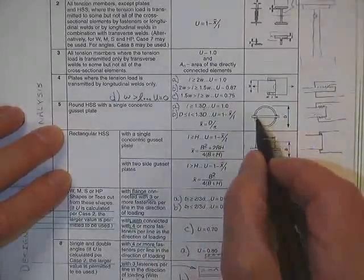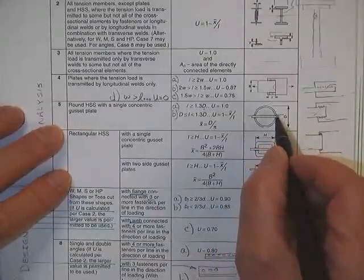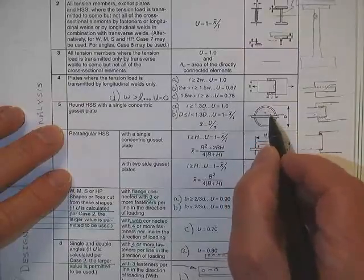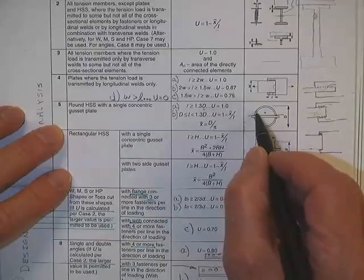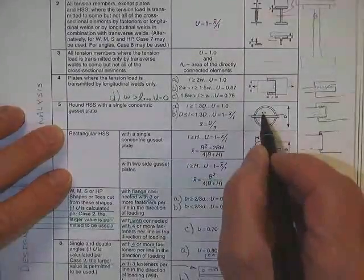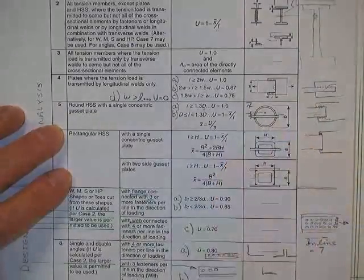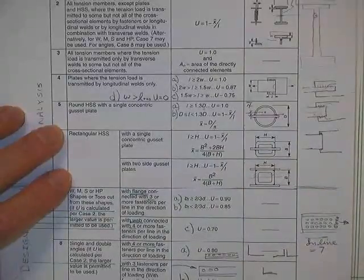And very interesting, I think, is if you will find out where the centroid of a solid piece is times its area, minus where the centroid is of a missing piece times its area, you find that the centroid of a circular segment is d over pi. And therefore, that centroid off of this thing right here, that's X bar. I admit it looks like it's in the Y direction, but that's what they call X bar.